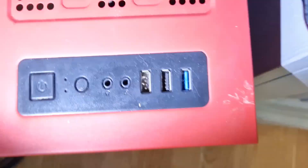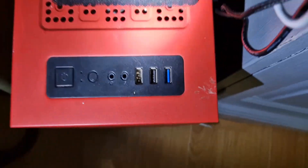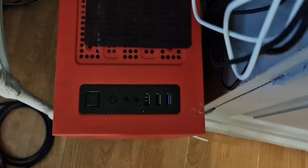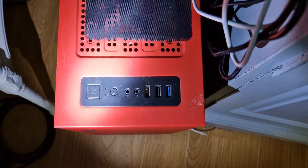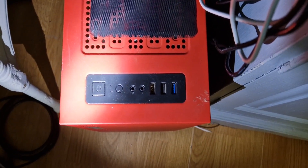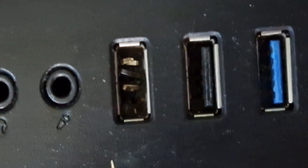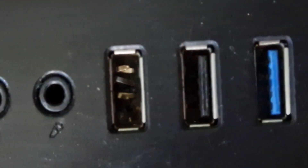Two of them are touching. So I'm going to either disconnect the cable — there's a USB cable on the board — disconnect it and see if it boots without the error. I'm going to try bending the pins first. There are four pins — I just made sure they're not touching.